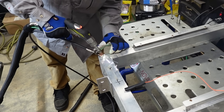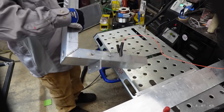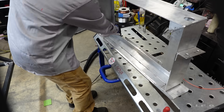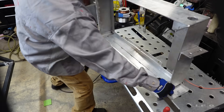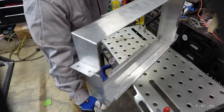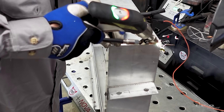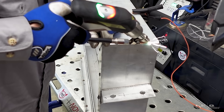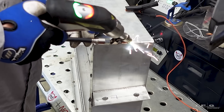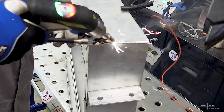Here's a pro tip for you: I am using 4043 filler wire because it gives a better bond with the 6061 aluminum. Another interesting thing about using laser welding, and specifically the wobble feature, is that it helps absorb some heat in the part so it mixes and stirs the filler wire with the base material more completely for a stronger weld.